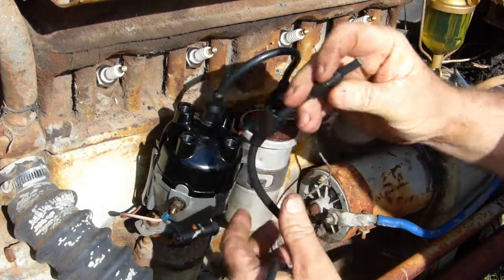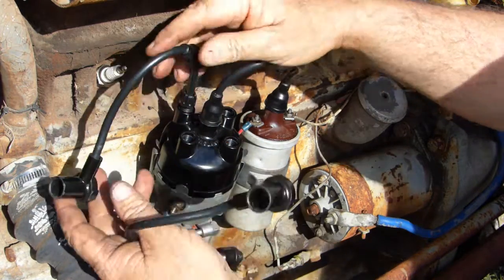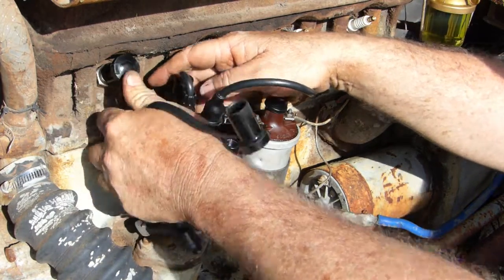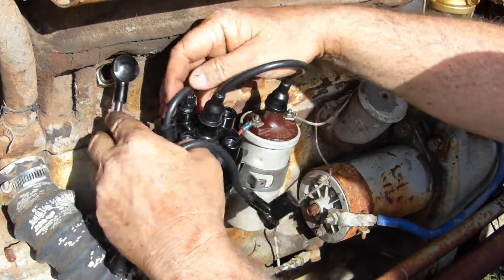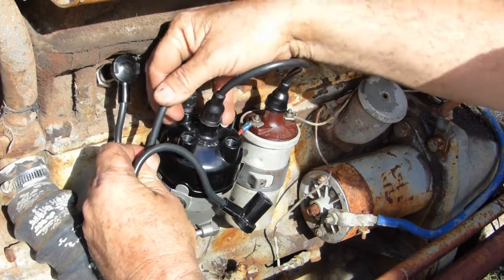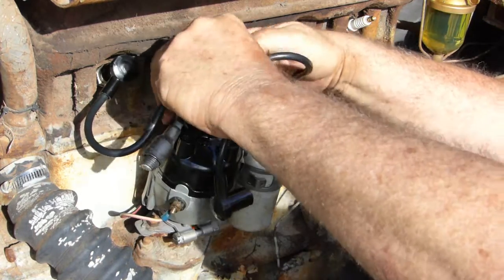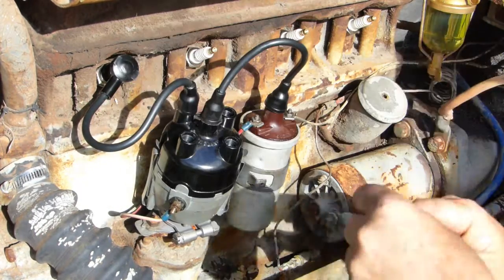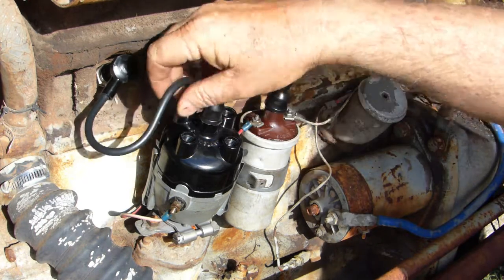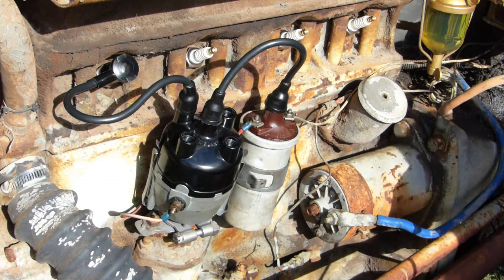Let's get the nut down, make sure that's clean. Started in the cap. And poke him on there. Now, I like to tighten that up now. Bring the boot over one by one, so that when we finish, we know we're all up to speed. Now, with the firing order being 1, 3, 4, 2, we know the rotor's going this way. So 1, 3.